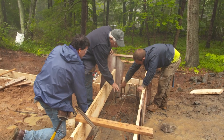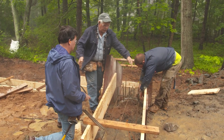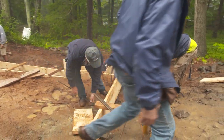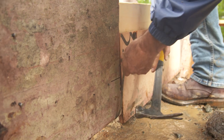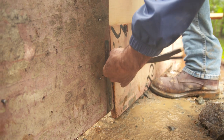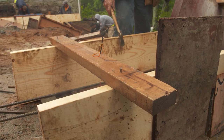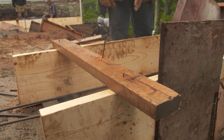So that's going to be wrapped there, and the bottom of the footing will be these three pieces of rebar. Now to hold the forms from blowing out from the weight of the concrete, I'm going to use this strap right here, slide it underneath the forms, and then bend it up on the sides — pull it tight. Nail that in there. Now that takes care of the bottom. And these two-by-fours, we'll run a series of these across the top, nailing it in from one side to the other, and that will stop the form from blowing out from the weight of the concrete. Once we have all the forms set, we have concrete hopefully coming tomorrow afternoon.